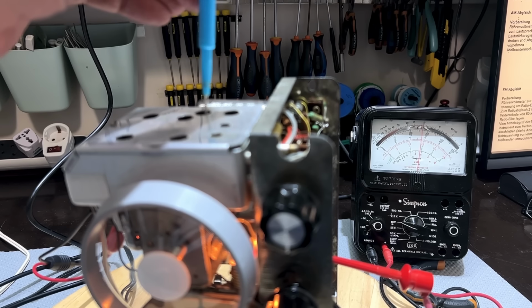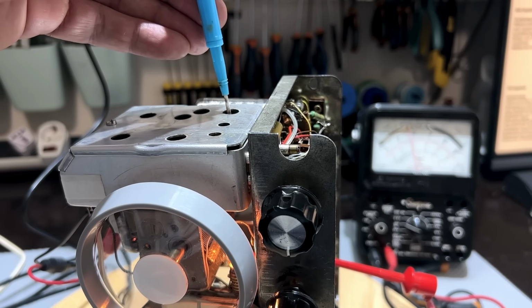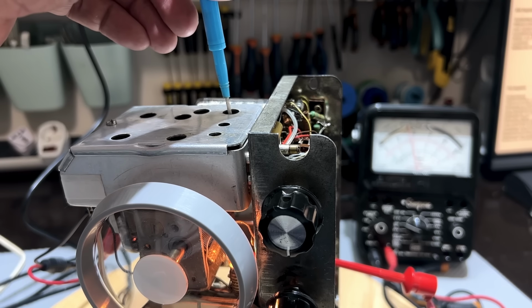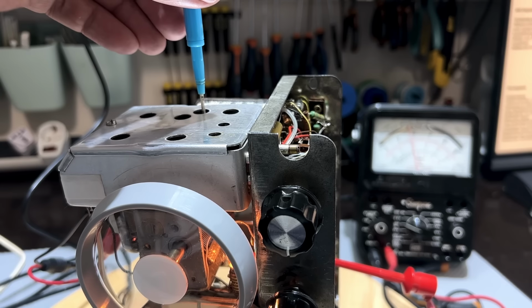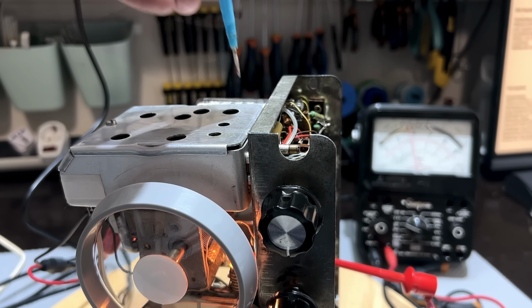It's pretty high. Now that's a little bit high, so I'm going to drop the amplitude to 5 millivolts RMS. Should see that come down. Actually, it's too low. Let's leave it at about there. That's 7 millivolts. Let's make it 6 millivolts RMS. And I'm going to adjust the other one. That's peaked. Try again with the other one. That's peaked. That was a peak.